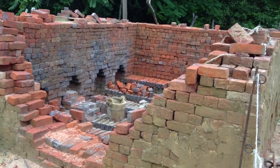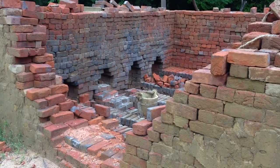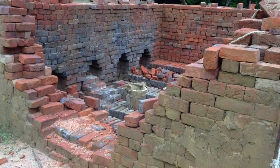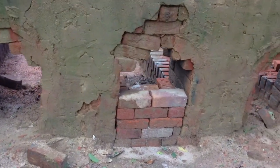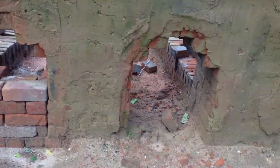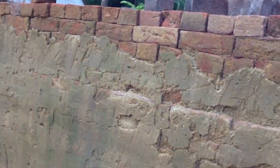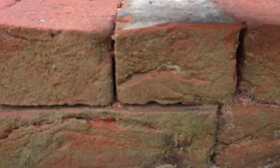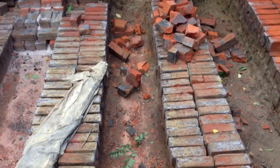This is where they're going to fire the bricks. They build a structure made up of all these bricks, and you see those holes — they become tunnels. They're going to burn a fire in them. The first day they keep it kind of not too hot. They put mud all over the outside of the structure, and they crisscross these bricks — see how this one is lengthwise and then these are crosswise. You can see the different layers, and there's the channel for the heat.